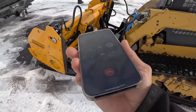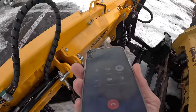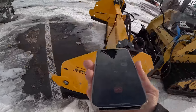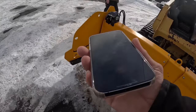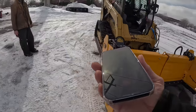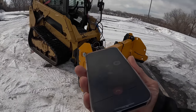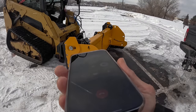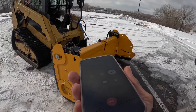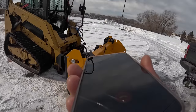Yeah, I noticed that the trip edge trips the entire blade. So the entire blade, when it hits something, is designed to move. Is that right? Yeah, that is right. And if you see the wings, you have kind of Dorflex on top. It allows the wings to flip too. Okay, so that means you can hit a curb directly head on without worrying about it. You just don't recommend doing it. I'm guessing you could. I don't know, NTN. You tell me. Yeah, it's a protection system. It's not built to constantly have a big impact, but it's a protection system. If you have an impact sometime, it will save the blade and the driver too.